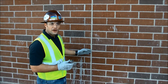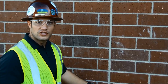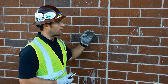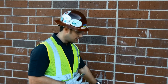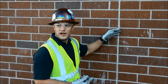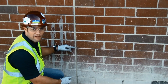It's always a good idea to start a little bit lower than eye level, because after I cut the sealant out, I'm going to have a hole and a breach in the sealant. A lot of people, when they walk around a building, are looking at eye level — not down by their knees. So do it in a less conspicuous spot, around your belt line or knee line, so that when you make the repair, the blending of the sealant isn't right at eye level. I'm going to do this at about two and a half to three feet height.